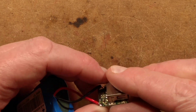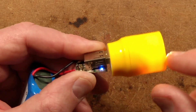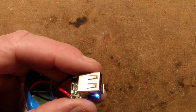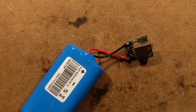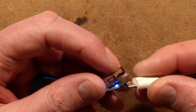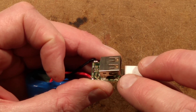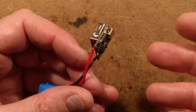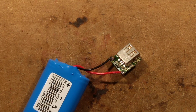We've got the LEDs at the front — let's see if I can plug a load in. A little flashlight. Yes, the little blue LED has lit, suggesting that if I was to charge it, the matching red LED should also light. I do have a USB lead handy — let's bring in the other 4 amp hour charger and plug it in. Yes — red flashing LED showing it's charging. So it's a fairly typical power bank, and if anything, because of that chip, it's actually slightly upmarket. It's just a typical USB power bank in its emoji-type case.